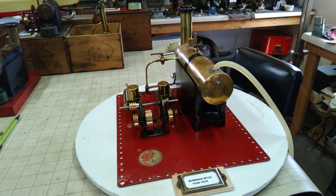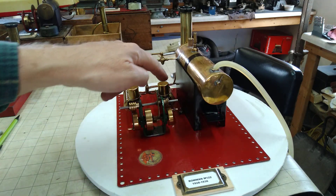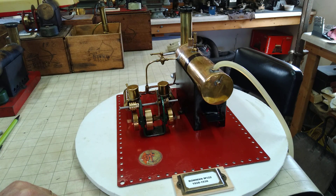I couldn't get this to run well at first. I just kept puzzling along. Finally, the right cylinder — I just kind of took the piston out of the cylinder assembly, and there was a little rubber O-ring in there. It just kept scrunching up and dragging it down. Once I removed that out of there, you can see it runs like a champ.